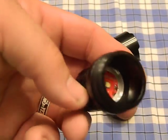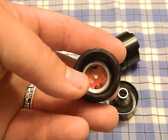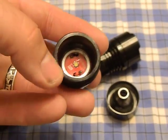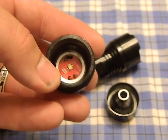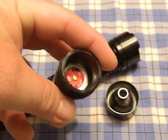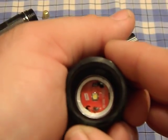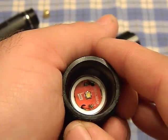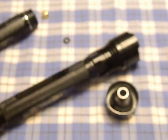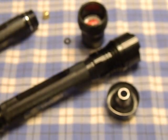Inside is your LED board. I replaced it with a Nichia 219c LED. All you have to do is screw out that little piece of aluminum, press fit the driver into the bottom, run the wires up through, and solder them to the LED. Very simple — took maybe 10 minutes.